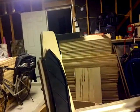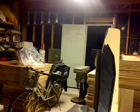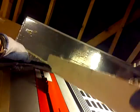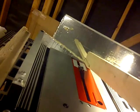And what I like about this is that it's longer, when you make your own, you can kind of see what I'm talking about, how different this is. You can make your own push stick, and I like mine here a little longer because when I'm pushing it out, I'm going to push it as far as to the edge, and it'll have a long enough lip to keep it, and then I can control the drop. So as it's going out, let's say like this, more like that size, I can push down on it, and then drop it out like that. Whereas this, I'm not sure how much.